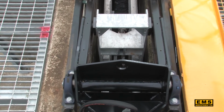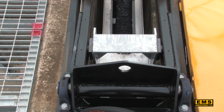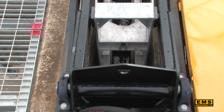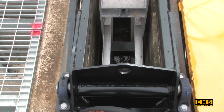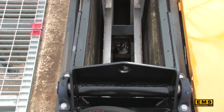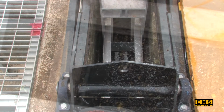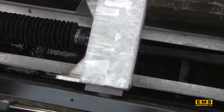The galvanized rake assembly is suspended from two or more scissor lifts. Each scissor lift features a travelling bogie running on wheels inside the arms of the scissor lift. The opening and closing of the scissor lifts generates the raising and lowering of the galvanized rake into the grit bed to drag it forward for draining and discharge. The stroke of the Hydrake is approximately 900 mm.